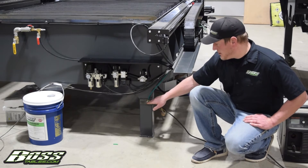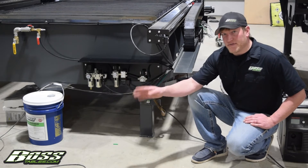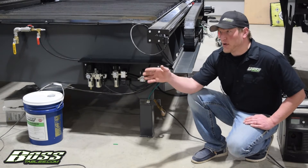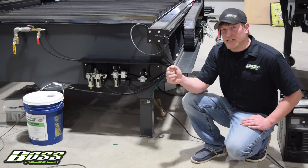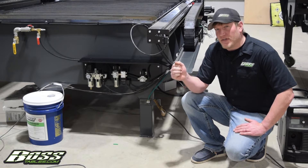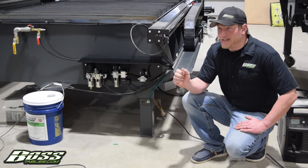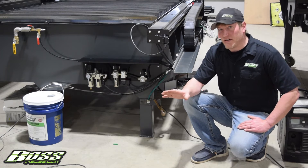We want to go from here with a ground cable to the power unit and from here to a ground rod — and that's very important. The ground rod cannot be a part of the building. You do not want this to be tied into your electrical circuits. It can cause noise interference with computers, noise interference with any electronic equipment, and just generally mess with other things that are in the shop.